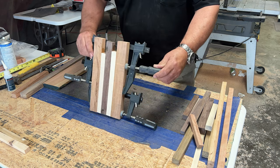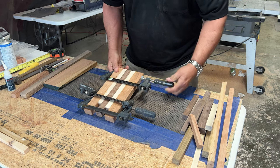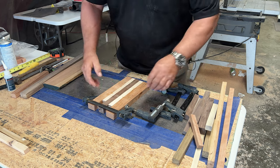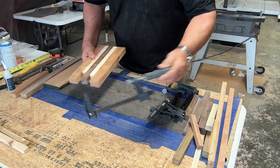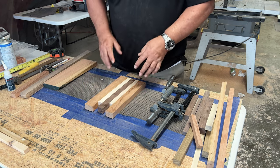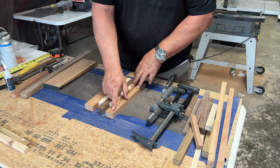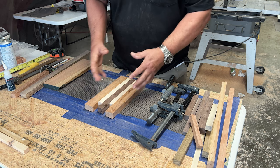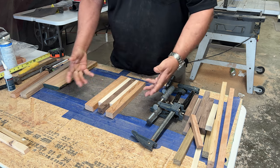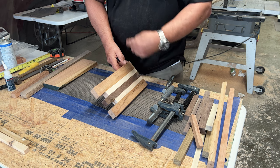It is the next day and this is all completely dry, so we're going to go ahead and take these clamps off and take this over to the planer to get it nice and flat. Now if you'll notice, I left these little long ends here, and there's a reason for that. A lot of times when you put wood into a planer, especially when it's small like this, there's a thing called snipe, and it typically happens right at the very end of the piece you're planing. So if you leave it a little longer, the snipe happens down here, which is going to be cut off anyway — that way, when it planes out here, it's nice and clean. Let's go over to the planer.